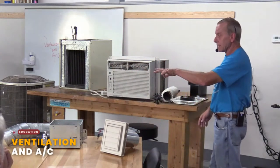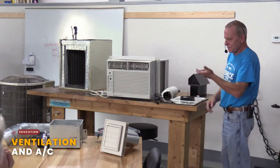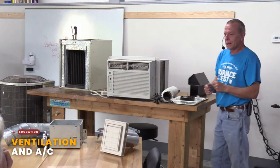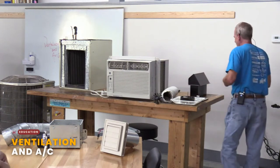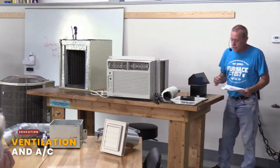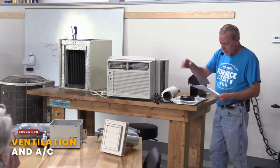Ideally, it's an insulated wrapped pipe. You can get a flexible pipe that has insulation around it already. That's good because you get warm, moist air moving through a pipe. Let's say a hard pipe like that is in a cold attic. What do you think is going to happen? Condensation, water issues, all sorts of things, right? So there's always flip sides. And it is amazing how much damage just water vapor can do to a home. So that's one way of thinking of that.